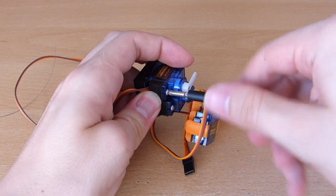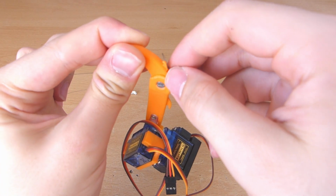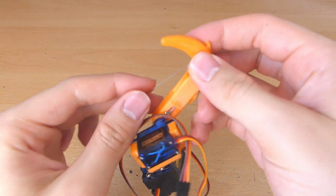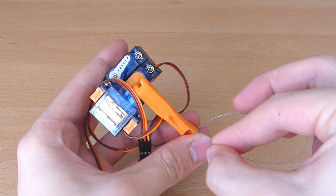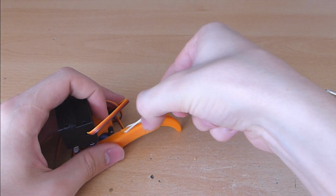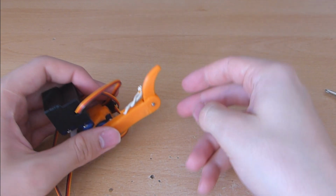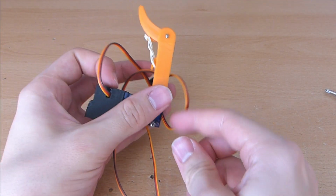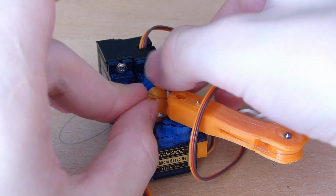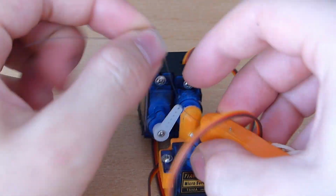And here I'm adding the servo which controls the knee joint. This is the string that actually attaches to the knee joint. I just used fishing line because it's very small, but it's also very strong. And in addition to that, it has very low friction, so it glides easily through the plastic pieces. The purpose of the rubber band is to pull the lower leg up, since it can only be pulled down with the fishing line. And here I'm just attaching the line to the servo to see if everything works together nicely.